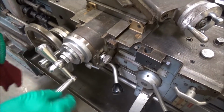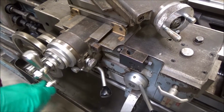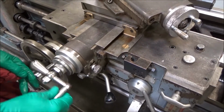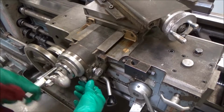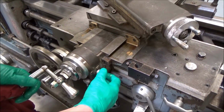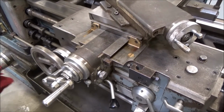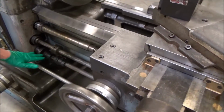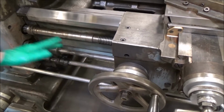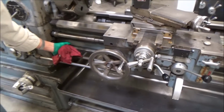It's got a little kind of a neat little latch up here. So if you bring this in, it's got a stopper going forward or back. You hit the stop at some point here, I think, and if you do, it's got a little stop in there like so. So if you got that up, then you've got a micro feed dial right there for a cross slide. Likewise, it's got a longitudinal stoppers. Doesn't look like they've been used for a long time, Pete. I didn't really check it out, but there's a stopper underneath there for supposedly kicking out the clutch. It's all old school stuff, but it may or may not work on that one.